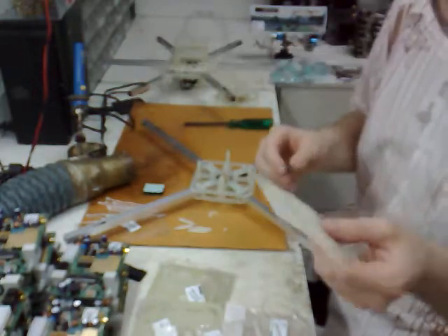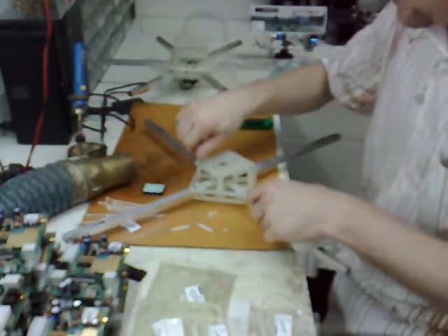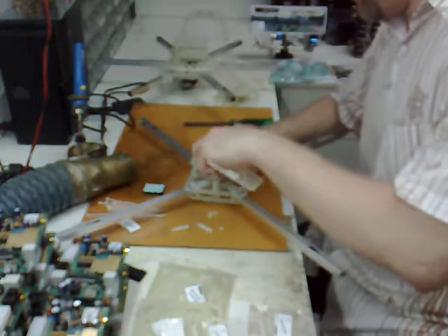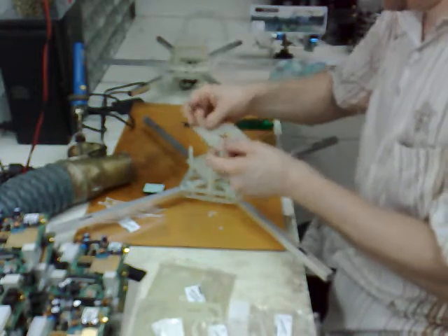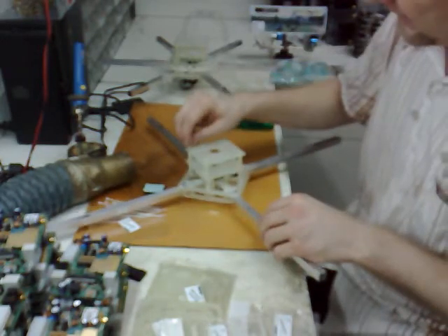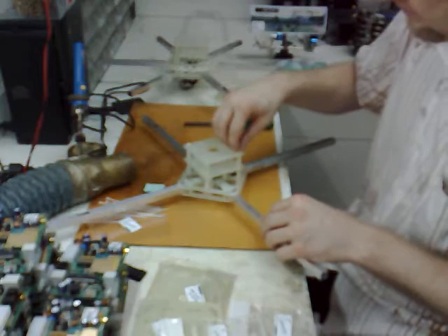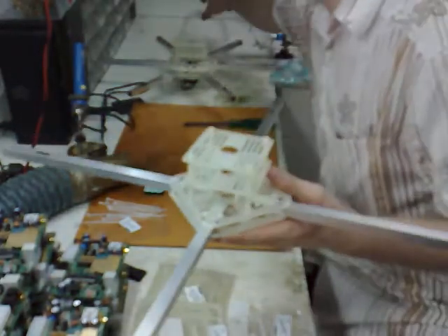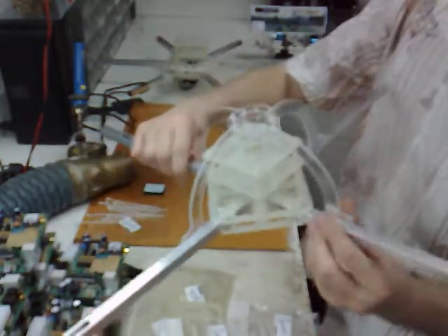We can continue mounting the carrier plates — corner, corner, corner. The second level uses 25 millimeter screws. And then the second level, and you can lock it down with the nuts — I just put them a little bit inside to show how to build it. This is how the whole frame should look when it's almost done. When you're done with the protective dome it will be mounted like here, and the fins will hold in here.